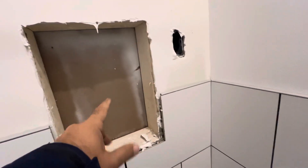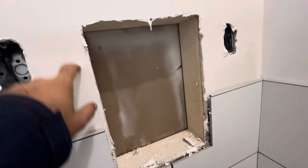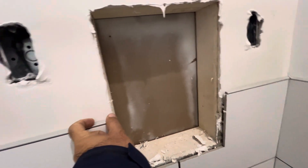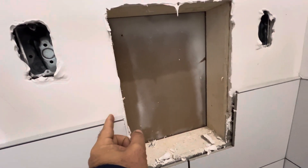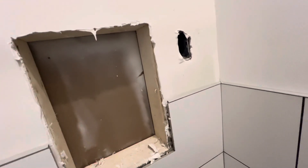Here I have a towel paper dispenser, so the metal will go around — about three inches around it. There's a spacing of one inch, so I will do three-quarter and then caulk it so it will stay flexible and tight. That's good.